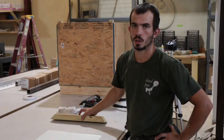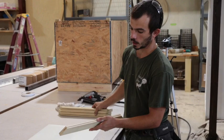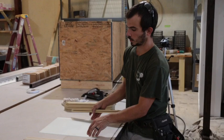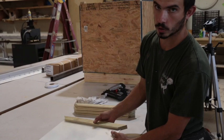Just finished our door. Next step is to make the windows. The way I make windows is I pretty much just make a picture frame, and what I'll do is I'll cut a little groove in on the inside of the picture frame for the glass to slip in. So this glass is a 16th, the saw blade's an 8th, so it's gonna rattle a little bit, but what we'll do is we'll put a little bit of caulk in there, and once that caulk dries, it won't rattle.